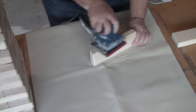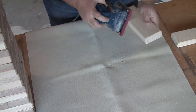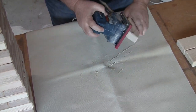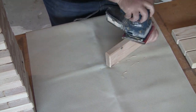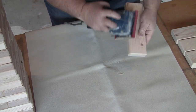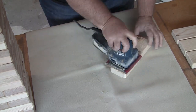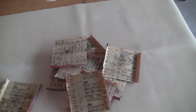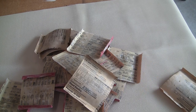The final step is to sand all 6 sides of each block. Make sure you wear a good mask as you're going to be producing a ton — and I mean a ton — of fine dust. I first sanded all 6 sides with 150 grit and then again with 220 grit to get each block really smooth. This step without a doubt is the most time consuming. Free financial tip: before you start this step, go ahead and buy some 3M stock, because you're going to go through the sandpaper.